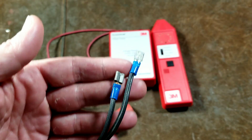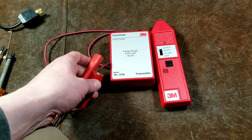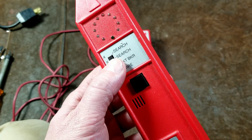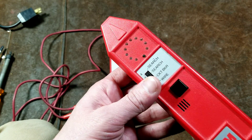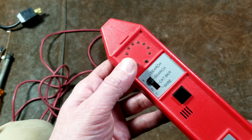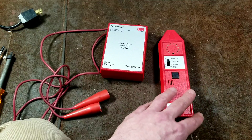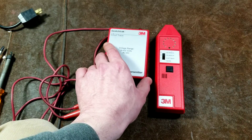Always make sure the contacts on your adapter cord are offset so they can never touch. The unit is essentially a little radio transmitter, and then you have this wand with various gain levels that you wave near wires. It beeps at a 4.5 kHz signal and has a ring of LEDs indicating how close you are. It advertises a maximum detection distance of several feet, though I'm not sure exactly how well that works — this is a much older unit from the early 2000s.